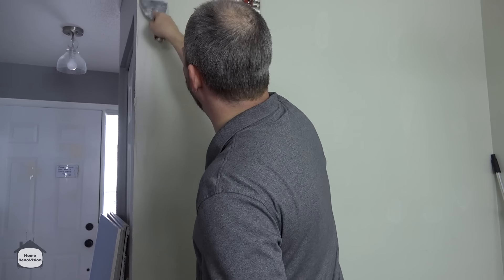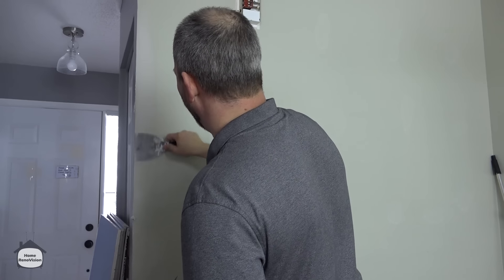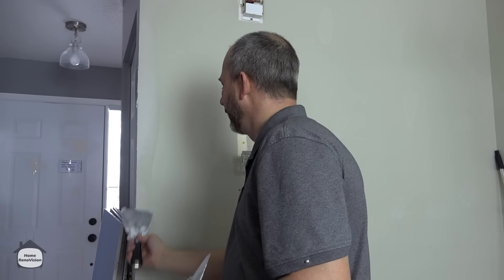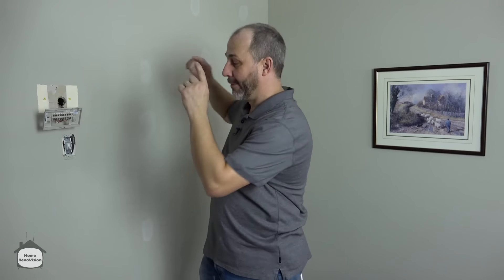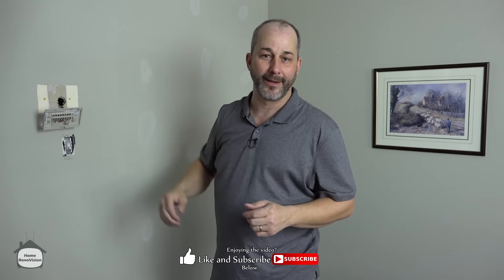Off the side of the knife, bit of an angle — done. Corner. Now that we've patched all our walls, I'm going to go around and do the rest of the room. By the time I'm finished, this will be dry and I can start painting. I'm going to remove the whole process of priming from the equation, take a little extra time to make it perfect, but not stop moving. I do one full cycle through the room — boom — right into the cutting and then right into the rolling. Three hours in and an entire living room is done.